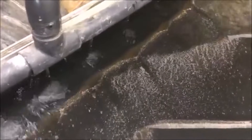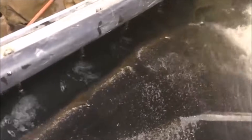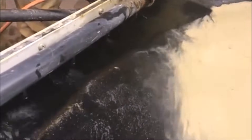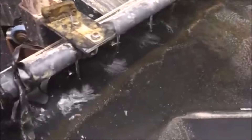We've stopped the table and here's our gold line right under the water bar. You can see that silvery material is actually steel out of the ball mill. The gold line falls all the way up to the top groove — most of the gold comes out of the top groove, with some coming out of the second long groove. When you get the magnetic steel out, it ends up being a nice clean line of gold.